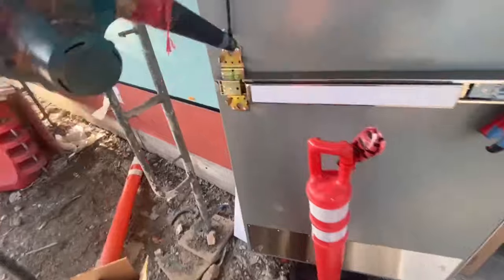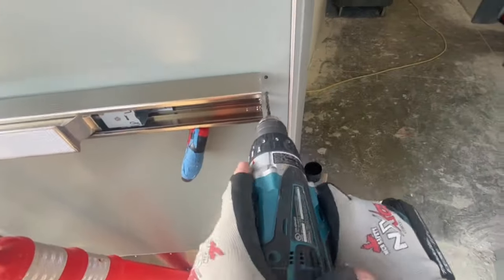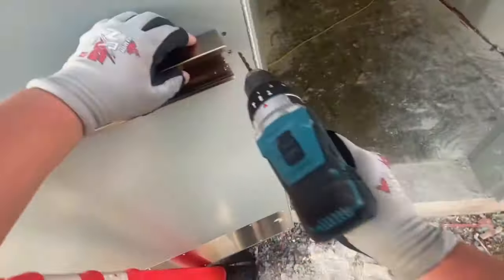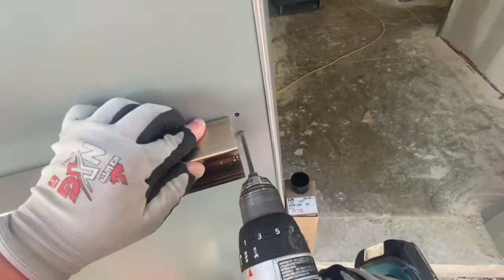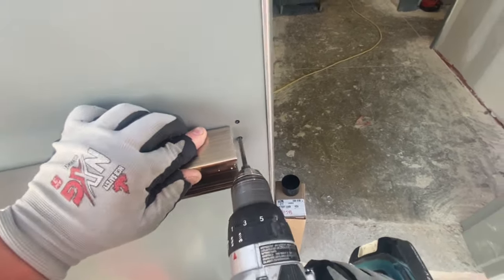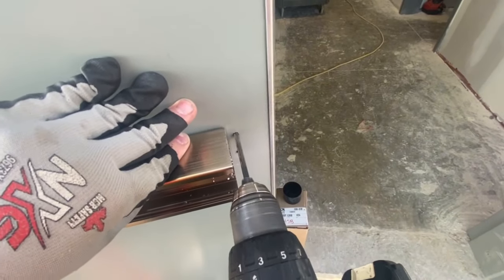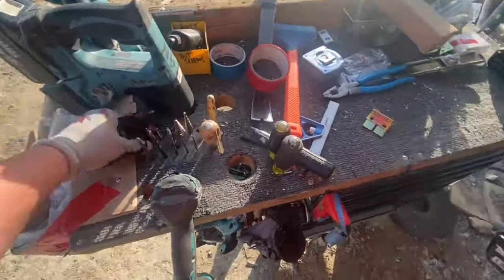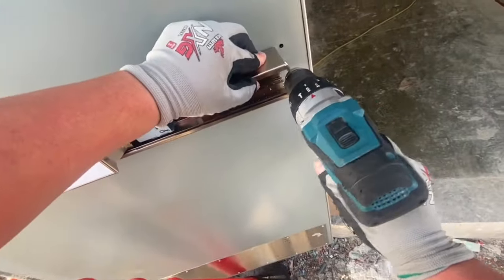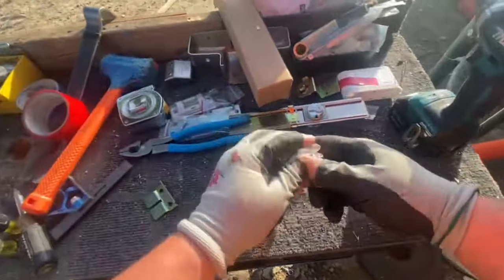And so you see there, I'm trying to get those metal shavings off. When you got moving parts and metal shavings, you don't really want those two to mix together, so try to clean it up a little bit. Here on the end, I gotta pull the bar down when I'm drilling the bottom hole, because the chuck can damage the bar a little bit. I'm gonna pull it up when I'm drilling that top hole, just because it's a little bit tight there. Same thing when I go to tap it. I'm gonna push it down when I tap the bottom hole, and I'll pull it up because that chuck's trying to get in there close to the door.